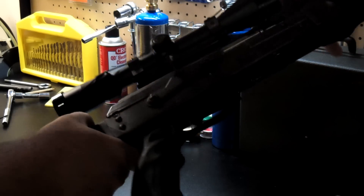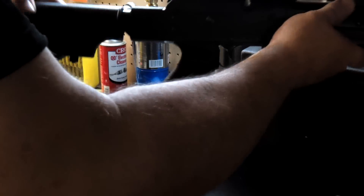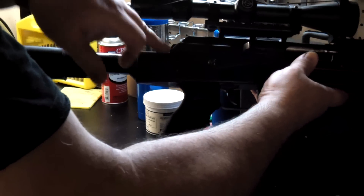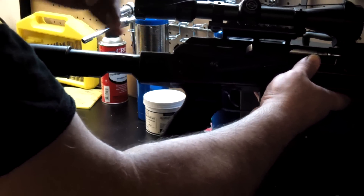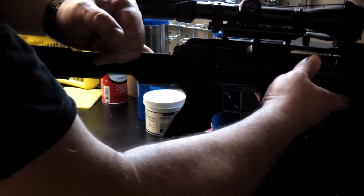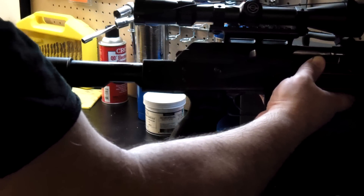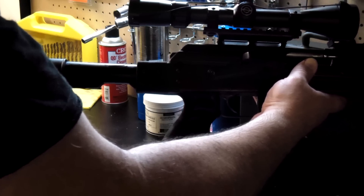I'm a practical guy — reasonable — and this looks good enough for me. So that's the Tapco M70 tactical stock with a little Dremel work. It's a bit shallow here to fit the bottom of the trunnion, so you need to remove some material, and after that fill the void for the slant receiver with epoxy. Everything looks good and feels good.